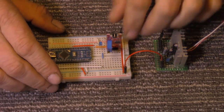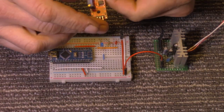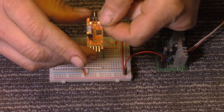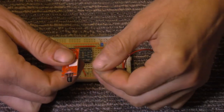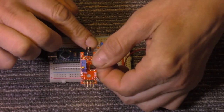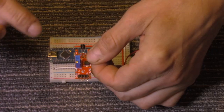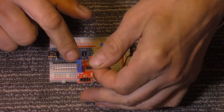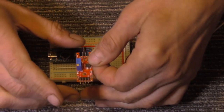I'm going to turn the power off and pull the sensor out here. On the top we have our little touch sensor. There's a little metal prong — it looks like a transistor, basically. The middle metal prong is just bent around it, and that's what you would connect to if you wanted to connect this to something bigger for touching. The other two legs go to the sensor board itself.